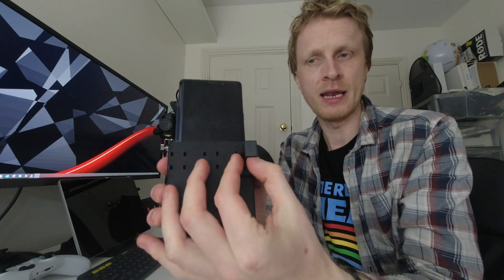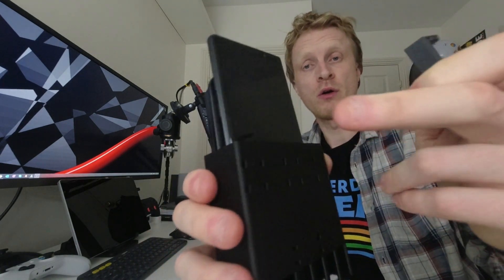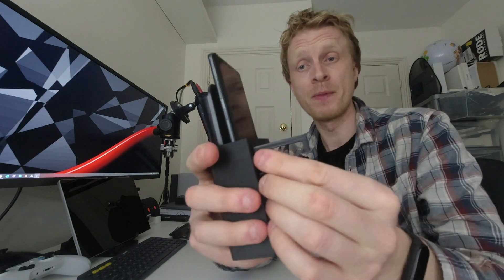So I scrapped that and did a quick tweak, adding a bunch of extra holes at the top — basically three pairs of holes. I can now grab two hooks, attach them on the left and right, and one in the center if needed, so I can switch around. They can be attached using cable ties — no super glue mess. I also created a loop thing at the back for cable management, where I can feed the cables through and keep everything in one neat position.